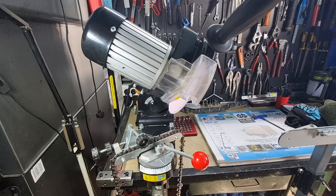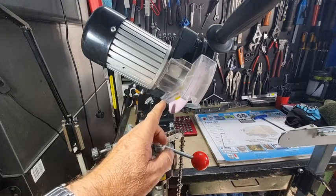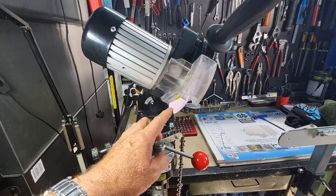The first thing is using the wrong size wheel. If you use a 4.7 millimeter wheel on a 3/8 low profile, you're going to grind the hook away a bit. If you use a 3.2 millimeter width one on a 3/8 standard chain, you could get away with it — done it many times, the shape won't be as defined but it'll still cut quite well. Try to use the right wheels; don't compromise unless you're in a spot of bother. Stick to what the manufacturers recommend: 3.2 millimeter for 3/8 low profile, and 4.7 millimeter width for 3/8 chain.